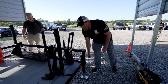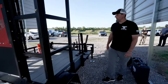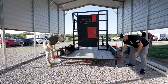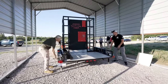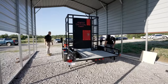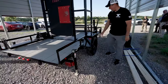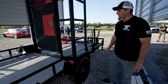You can see the front is slightly up from the back, so now we're going to go ahead and level it off by cranking the back up. Two people, literally under a minute, set this up. The most important thing is — you can see over here — the tires need to come up off the ground so that you're taking the suspension of the over-the-road trailer out of play.